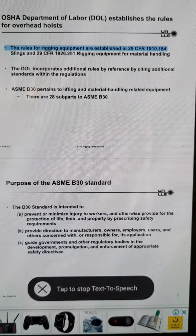Lecture 32. Hoist ring don'ts. Do not use if any part of the hoist ring is damaged. Do not use if placard information is missing or not legible. Do not use a hoist ring if it is not tightened to recommended torque. Do not use if the hoist ring does not swivel. Do not use washers in between the hoist ring and mounting surface. Do not repair, replace, or modify any piece of a hoist ring.